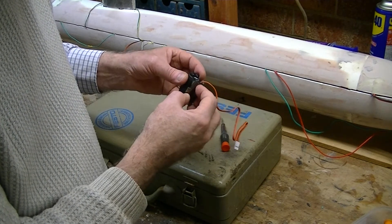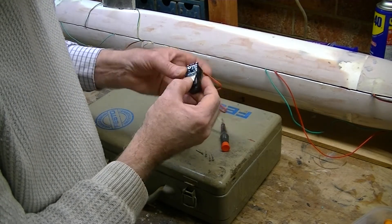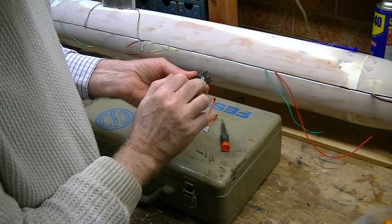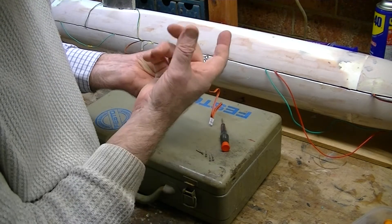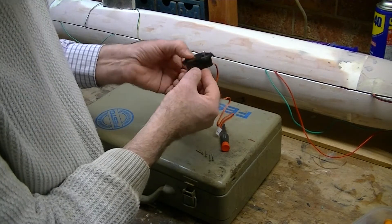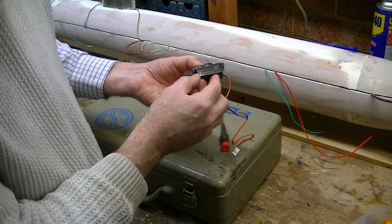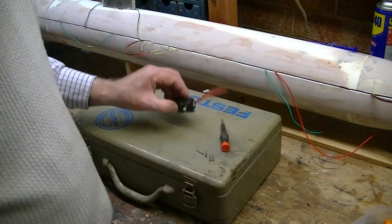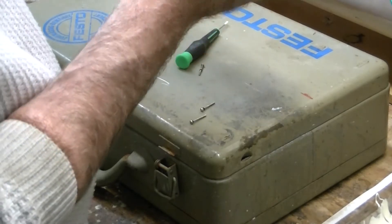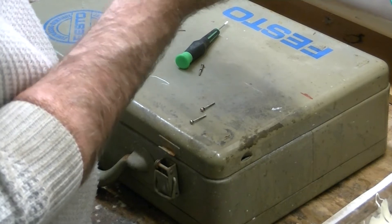I'm going to do a really good job of the silicone around the base, fasten it up, then leave it. My plan is to put a tiny hole right here and use a syringe to drop some oil in — baby oil — and fill the whole thing up, then seal that, which will finish the job. What's also good about this servo is there are no other joints up there — it's all sealed — and it will slot straight in so I can easily seal that part as well.